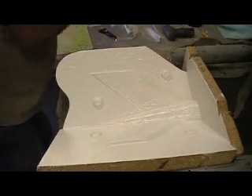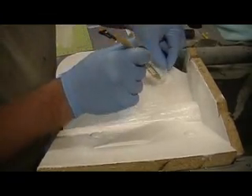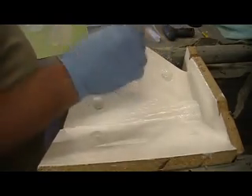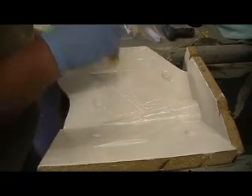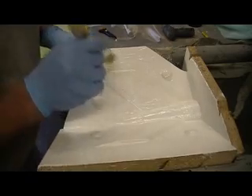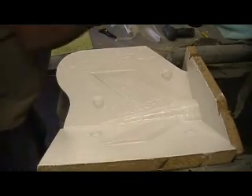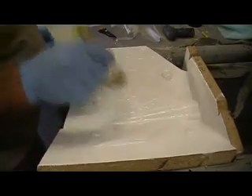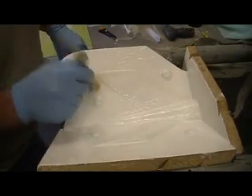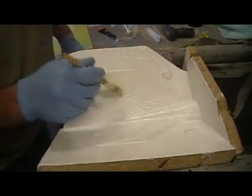So don't put too much resin on your brush. We don't want super sloppy resin on there. But anywhere we got the slightest little angle, we're going to put some three-quarter cloth because this stuff folds around them corners. I'm going to put a couple, three layers of this down, then do it with six ounce cloth, just little pieces. I just got a bunch of little squares cut, all for these little corners. And this will keep your mold from chipping out — guaranteed.